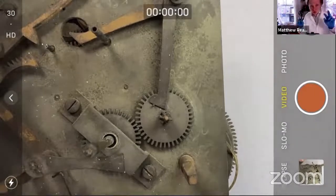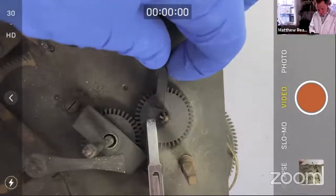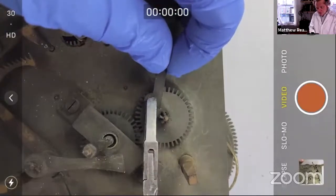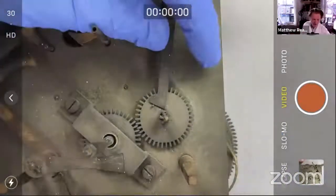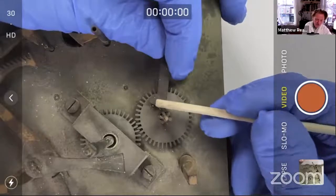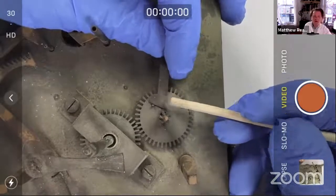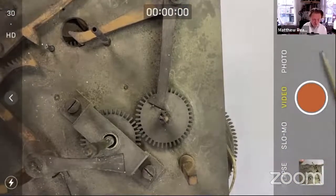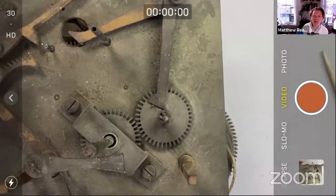So how this should be, no should, is that, lift that up. If I got hold of that there and bent it round to about 45 degrees, what would happen is as the hands are turned backwards, the lifting piece rides up on the base of the pin, and it doesn't break the hands. You can actually turn the hands backwards. So we might be able to tell whether it has ever been different from this by looking for scratch marks on the back of the lifting piece.